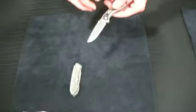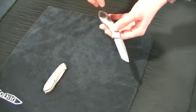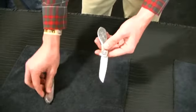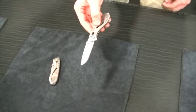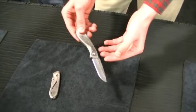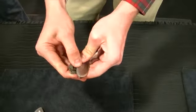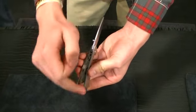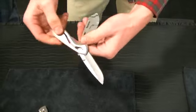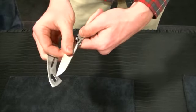We have a prototype here of a very soon coming knife — titanium, and since it's a prototype that's why they're a little rough. Titanium handles, titanium clip, S35VN steel hardened to 59 Rockwell, titanium thumb stud, stainless hardware. The interesting thing about this model is that there are no screws or any traditional hardware. I can disassemble it — the dovetails simply disengage. The entire knife comes apart and goes right back together just the same.